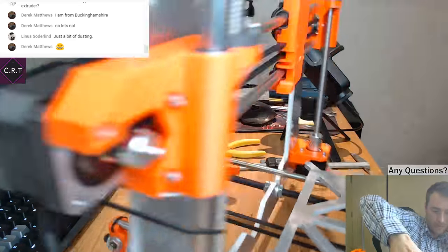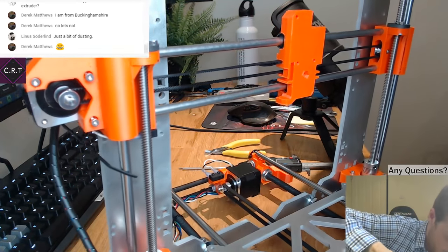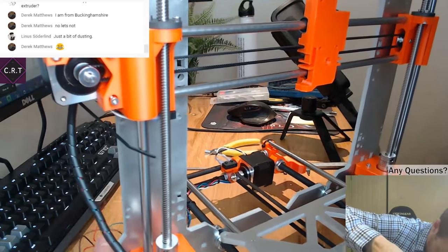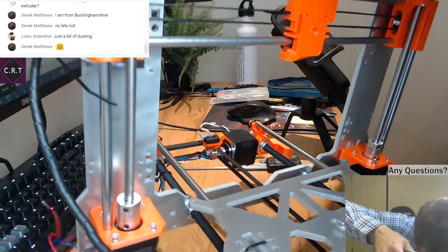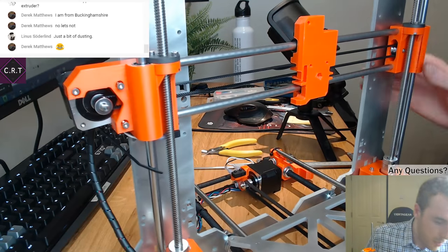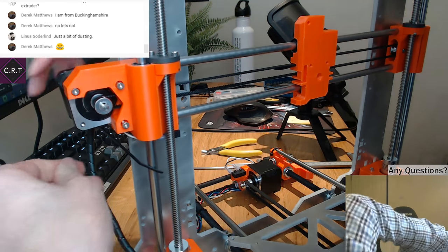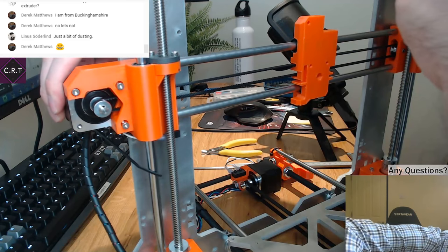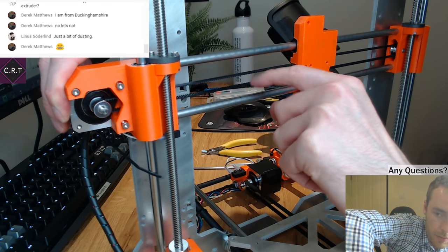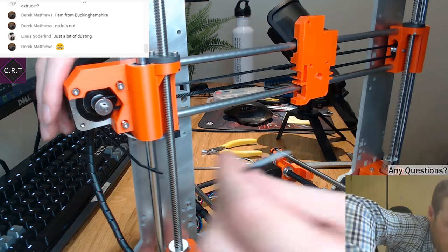So now what you do, come back around to the front and try not to cross the tiny little cables. Blooming cables! And it's so heavy. Right. So back to here, oh, I might have done it too much. Yeah, see? You see how that works? So that's sort of slack, tighten up slightly, and now it's tight. So that's all you have to do. Loosen the stepper motors, place your belt on,